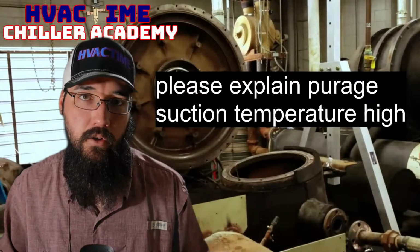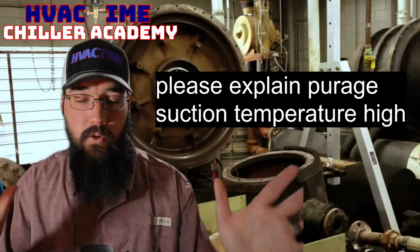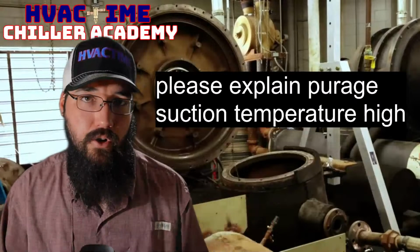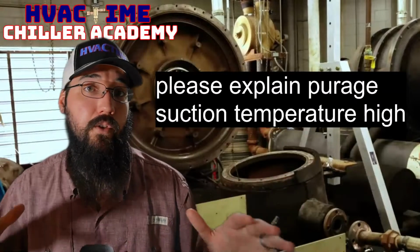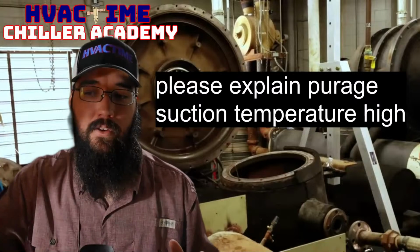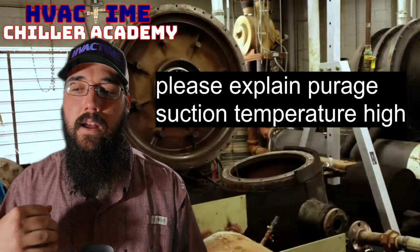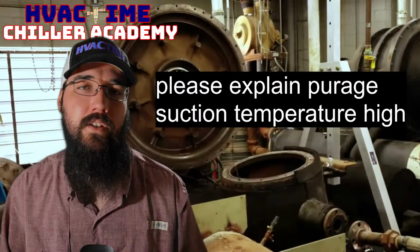And so then it'll give you a low charge scenario. And I've had that happen before. Leak search the whole thing. The whole purge is perfectly fine otherwise. Give it a fresh charge and it does great. No further issues from there, right? And the evap temperature starts to come down. Everything goes to work from there. So it's just one of the things to consider, right?